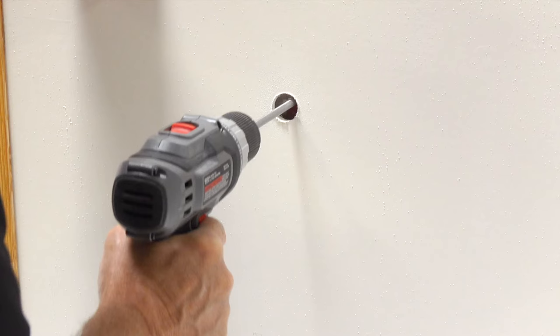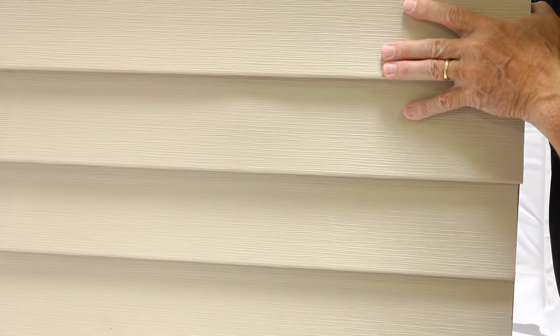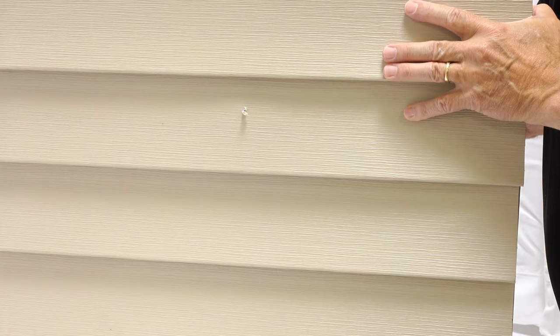As you continue drilling, when the drill first makes contact with any insulation, move the drill forward very slowly at high RPM to make sure the sharp cutting edge of the drill bit has a chance to cut through the insulation gradually without snagging. Forcing the drill bit through the insulation quickly may cause it to snag. Once the drill bit hits the outside wall, with your helper watching the outside wall, apply steady pressure until just the tip of the bit breaks through. Your helper should signal you at that point to let you know that just the tip has emerged. Then slowly back out the drill.